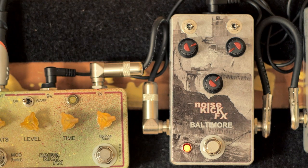The 1904's layout consists of volume in the middle, tone to the left, and gain or distortion to the right. Above those, we have two different three-way clipping switches. These are going to select up to nine different combinations of clipping diodes. Different varying settings will give you different volume, gain, and compression.